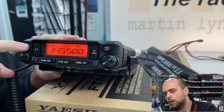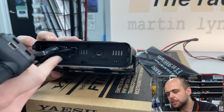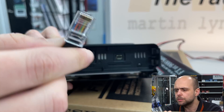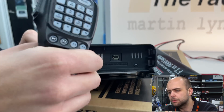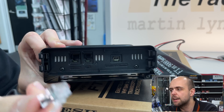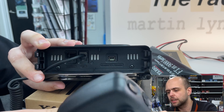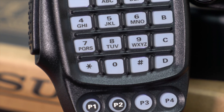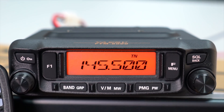I'll just quickly turn the radio off so I can take the front panel off, just to show you behind there. We can see that the front panel is attached by a standard RJ45 connector, as we've seen them do now on a couple of radios. And the microphone, which plugs in behind that front panel into the main body, is on the standard RJ11 type that Yaesu have been using for many years for their mobile radios. So let's plug the microphone back in — that just routes through that cable hole there — and we'll plug the detached front panel back in as well and clip it on.